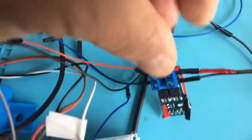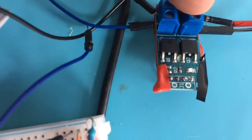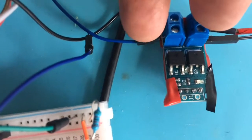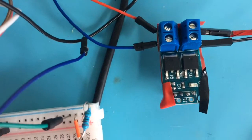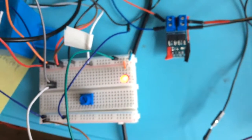So what's happened then is they've developed these things called MOSFETs that are in the transistor family that don't have physical switches, but the switches are in silicon. And these MOSFETs are very low power, and they're capable now of driving a lot of energy. So what they've done is they put these MOSFETs into battery management systems that switch between these cells. Now, battery management systems have to monitor all four cells in my battery. And they do that with MOSFETs.